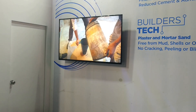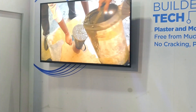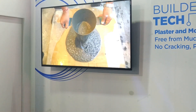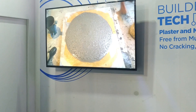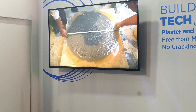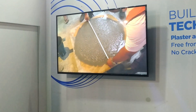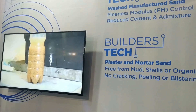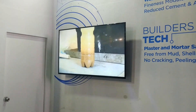This is the next test — the slump test. This is a self-compacted concrete. Fill it. The concrete flows down and is measured. When the concrete settles down from the conical chamber, exactly 12 seconds should pass. If it passes in 12 seconds, this is self-compacted concrete; if it doesn't, it is not self-compacted concrete. The measurement is taken as the concrete flows down.